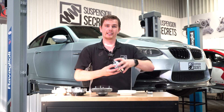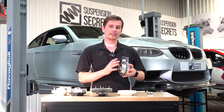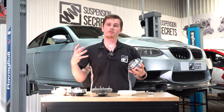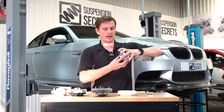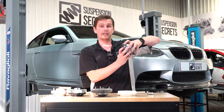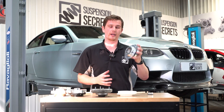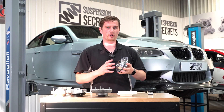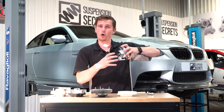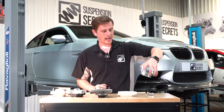We managed to achieve that in the final design by including a bearing here — basically the lower spring base has its own independent bearing that is press-fitted onto our core, which has more than enough resistance-free movement so you can turn your wheels without any resistance or spring bind. This is also completely independent of the top part, so it can move completely independently as you adjust your camber and caster, meaning we can do camber and caster adjustments from the top while still having that rotation and movement.